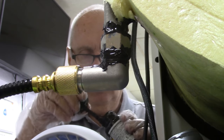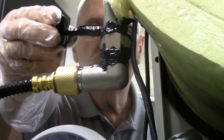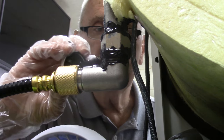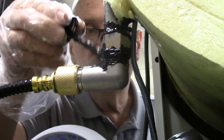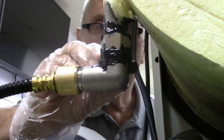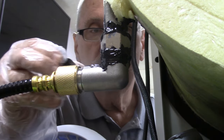I have to wear glasses — that's what happens when you get old. On the other side over here, it'll look ugly right now, but after we put that stretchy tape on it, it'll smooth right out. One thing nice about the liquid tape is it stays flexible. So when these machines get down to really cold temperatures — minus 30, minus 40, minus 50 — RTV is not pliable enough to get down in the cracks. Some of the other epoxies they use are too stiff — they'll just sit there and crack and you're in the same boat you started in.